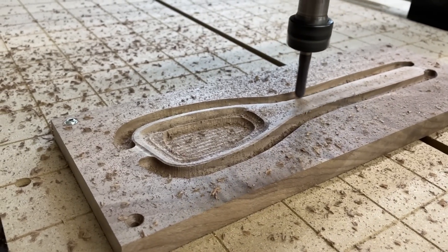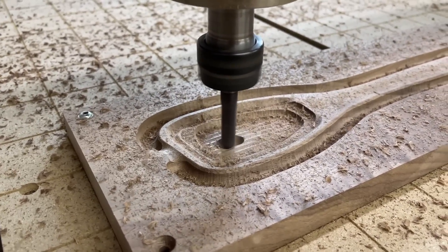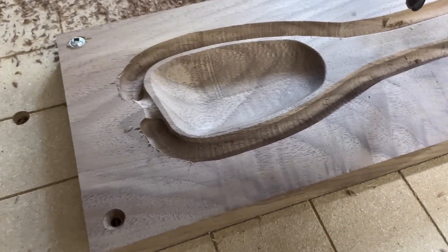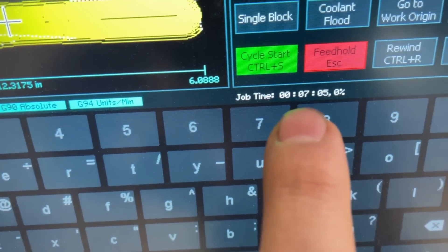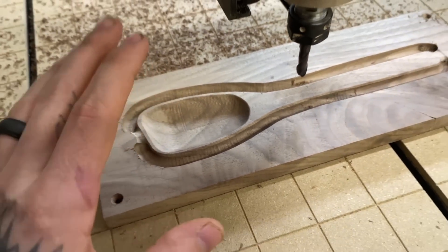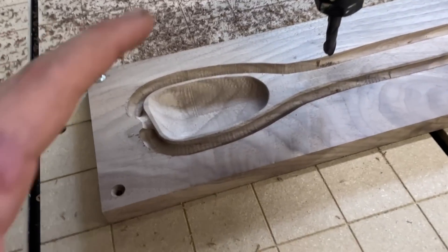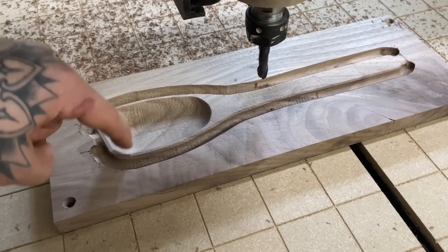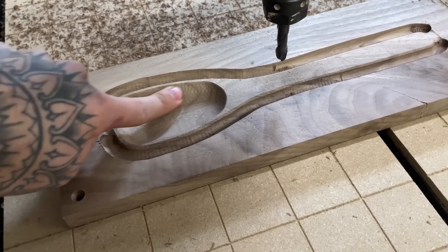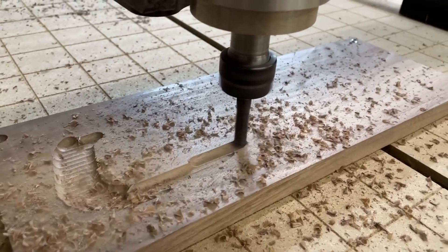We're going to go ahead and cut something on this machine just to break it in. I've been on a 3D modeling kick so I figured a great first carve would be a Spoonchula. I totally guessed on all the feeds and speeds — after several carves I'll be able to dial these in. I carved this entire side in 7 minutes, so that means I could do both sides in under 15. I did get a little bit of chatter — I ramped everything up from what I normally would, so I don't know if that's just me going too hard or if it's the tiny bit of play in my bench. I did the finishing at 220 inches per minute with 7% stepover, and the roughing at 150 inches per minute with 0.15 depth per pass and 40% stepover.